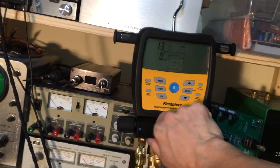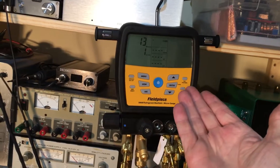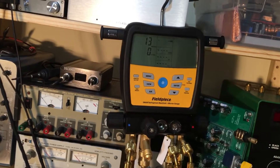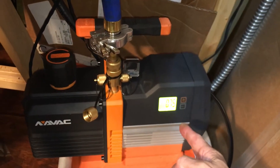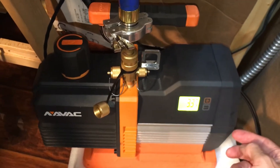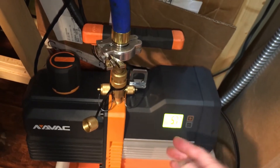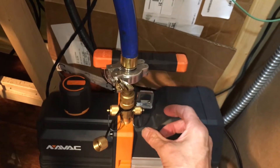Vacuum is off. It's not going up. It might go a little bit up by tomorrow. Let's kill the pump. The pump is dead. There's a little bleed-by there. I have it switched off right now but there's a little bleed-by. I heard a click — the click was the sealing of the solenoid inside shutting off the vacuum.